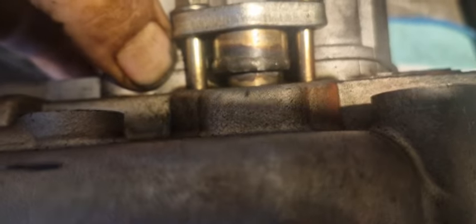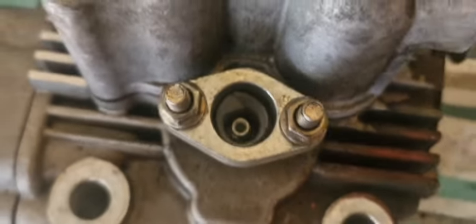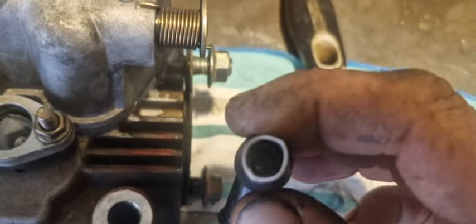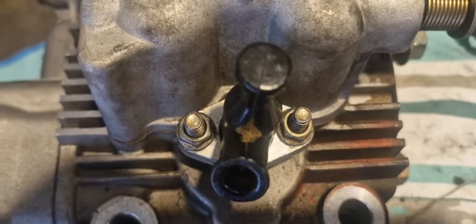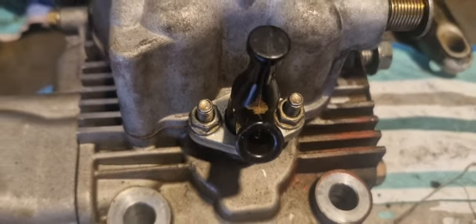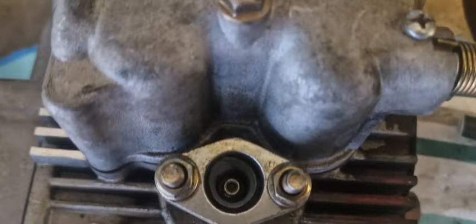It's been pressed inside a 15 millimeter to 20 millimeter stainless steel pipe, and then I put 0.8 millimeter Teflon around it because the normal spark plug thingy didn't fit anymore. So I made Teflon around this for isolation, and some tape, and Teflon around there. Now it can go inside, so you have almost 1.6 millimeter Teflon layer in between with some air, and I hope that will do. It can also sustain quite some temperatures. Teflon can take up to 250°C and it'd be okay.